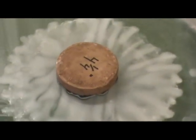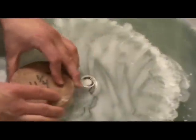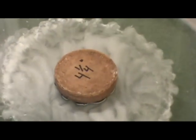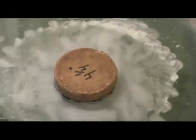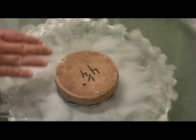Going back to the W stroke, I also do a little variation there. I might do a six-stroke W where I go one two three four five six — that's a full cycle left and right. I'll do that for a minute or two and then make it an eight-stroke cycle. With the W stroke it's also good to put in odd-numbered strokes — I might make it a seven, going one through seven. The nice thing about an odd number of strokes is that your strokes on the way back hit in a different place than the strokes on the way out, giving you a little variance left and right. The whole point of all this variation is to not do the same thing over and over, but to have all of those strokes working towards your general goal of correcting the mirror — deepening the center and correcting the figuring.